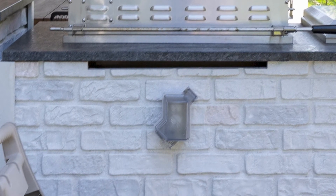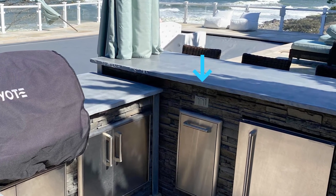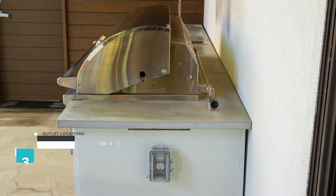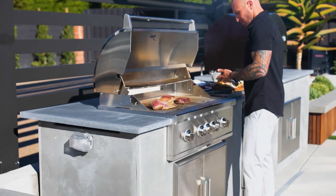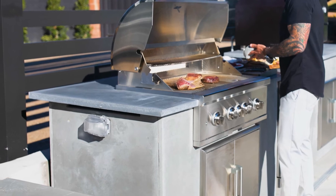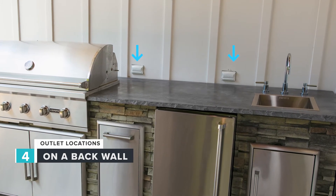A second option is an outlet on the back or front panel. It can be easiest to add an outlet on the back panel as you typically aren't restricted on space. The front panel is a more convenient location but there is not always room due to appliance placement. Third, an outlet on the side panel is a great option if your grill is going to be located at the end of your island, since the motor can be flipped from left to right. Fourth, an outlet on a back wall is a great option if your island is going to be up against a wall — you can have an outlet mounted on the wall in the back. If running an outlet for your rotisserie cord is not an option, you can use an extension cord as a last resort, but we would not recommend doing this.